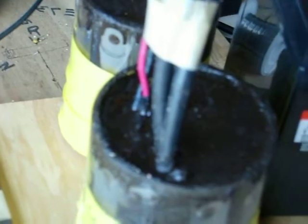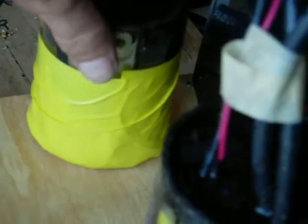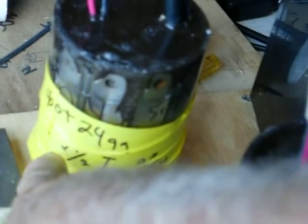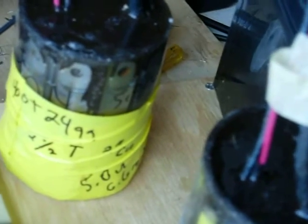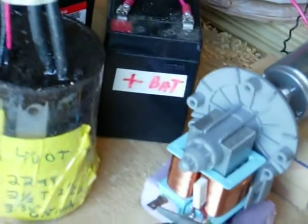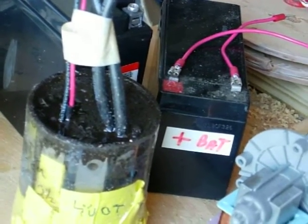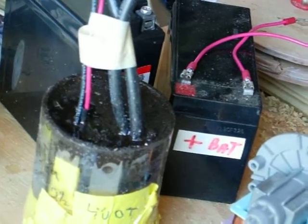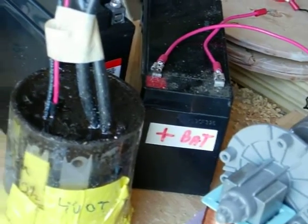These are the high voltage output portion. They're about 6.8 millihenries on this one, which is a 22 gauge. This is going to be the first one I'll drive, and then its output drives the second one on the high voltage side — that one is 24 gauge. Each are 400 turns. The copper is two and a half turns, two inches wide — pretty thin stuff, easily bent. I noticed in the 'How It's Made' video on pole transformers they show eighth-inch aluminum plate being bent, but I kind of doubt that was eighth inch — maybe sixteenth inch would bend like that. To get right-angle bends in eighth-inch aluminum you'd need a lot of machine work.